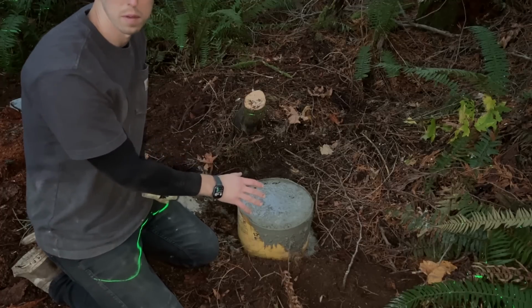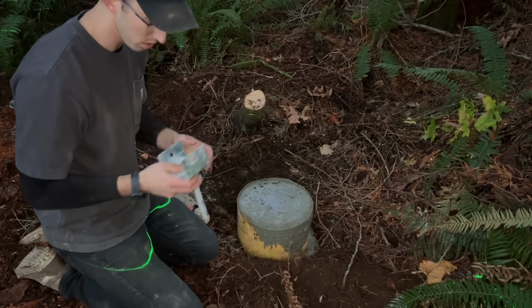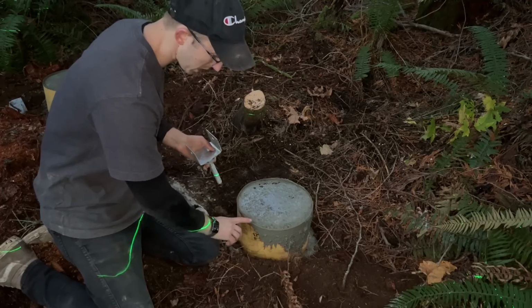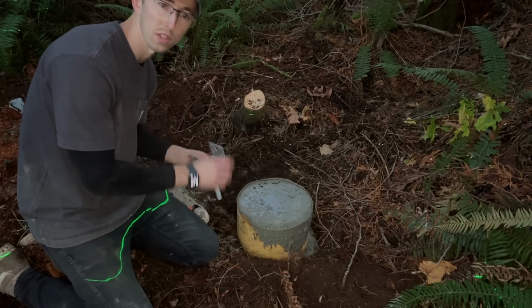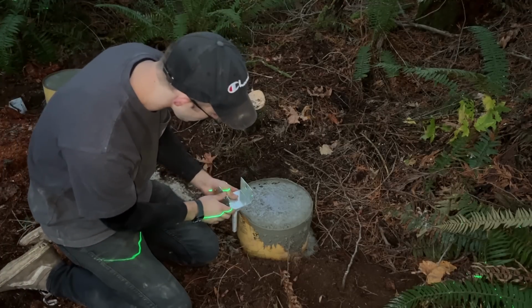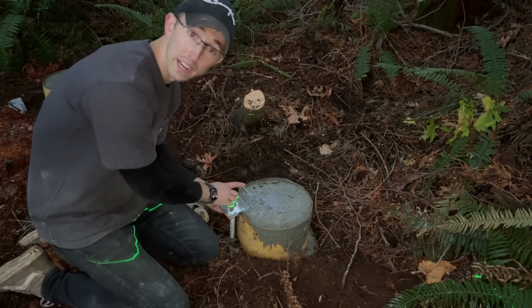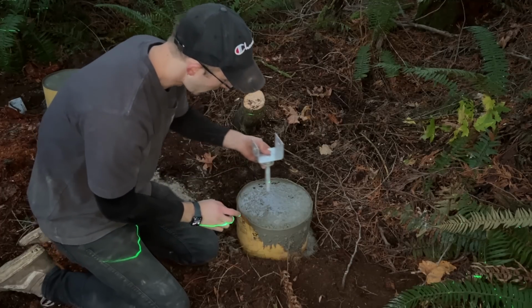It's been about 45 minutes now. We're running out of daylight, but I'm gonna be setting all of these anchors now. The plan is because the top of all these is roughly 1/2 inch to 3/4 inch off of each other, I'm gonna do all the fine tuning and take the laser line that's shot and line it up with the top of these mounts here and then set it.